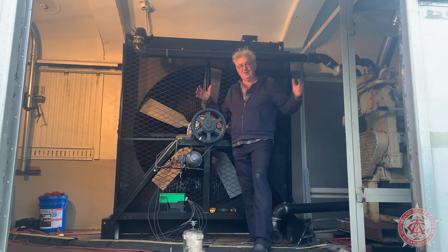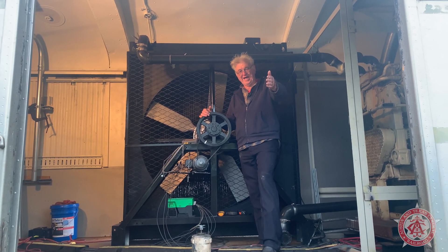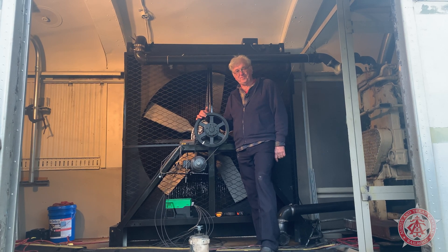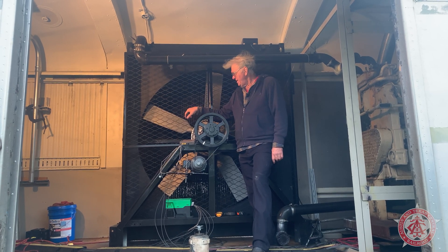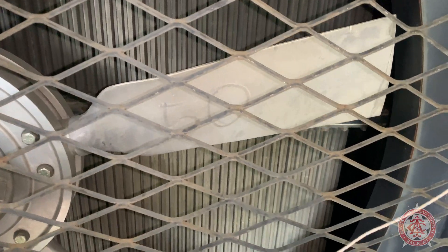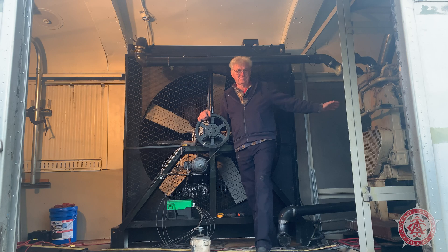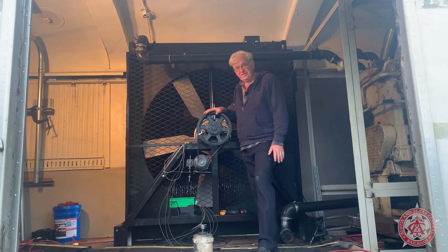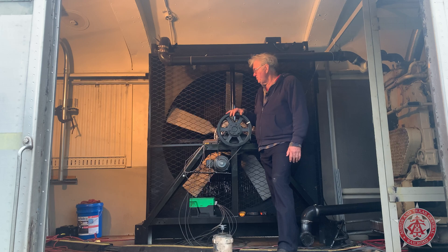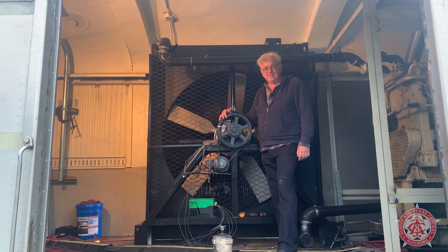The first question is: why so big a radiator? This radiator is so big a cameraman has to stand outside on a ladder just to get it fully in frame — but that's not why we got a big radiator. There's a '50' on this blade; it says it's made for a KTA 50-liter generator. This little guy here is a KTA 19 — 19 liters. You can see the relative difference in size. But if you've ever been around one of these big radiators spinning at full speed, it sounds like a cyclone. It's like a leaf blower blowing everything away.